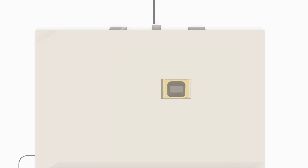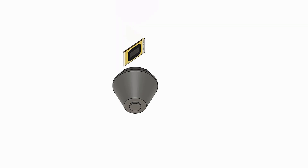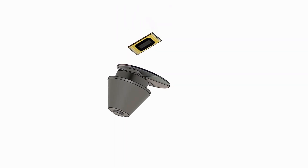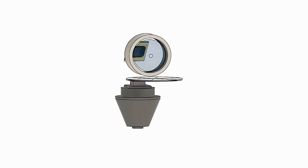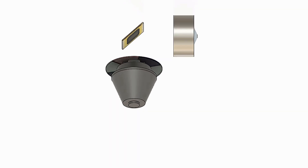The only type of projector that can achieve high frame rates is a DLP projector. They use micromirror devices called DMD chips. The DMD chip consists of millions of tiny mirrors — each mirror represents one pixel and can be tilted in two directions called on and off positions. Because of the small scale, they can switch very quickly. Home DLP projectors use one DLP chip and process RGB light sequentially using a rotating color wheel. A single image is actually a sequence of subframes of red, green, and blue image components. Due to the persistence of vision of our eyes, our brain sees a complete color image.